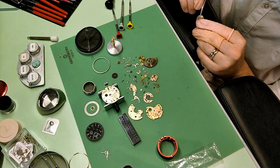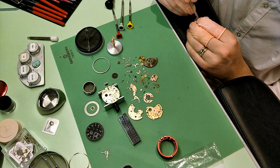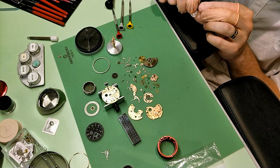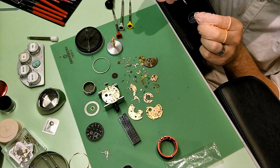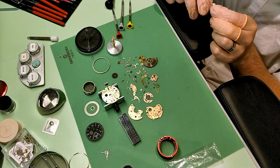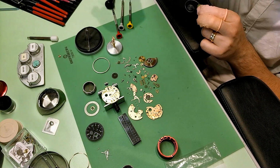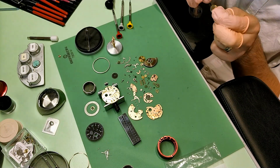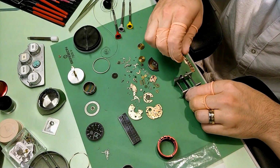And presumably when it's fully wound in an automatic watch, the spring just turns freely within the barrel? Well, it shouldn't too much. Yes, it should, but it should have a grip. So when you stop winding it, it's still in position until the next time you charge the watch. You've got some nice little grooves, so it hooks up until the next time you charge it again. But yeah, that's a long mainspring.